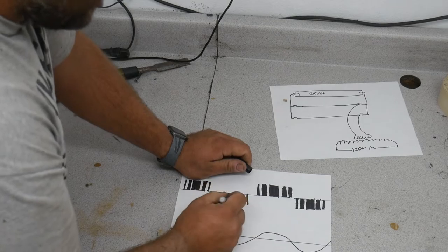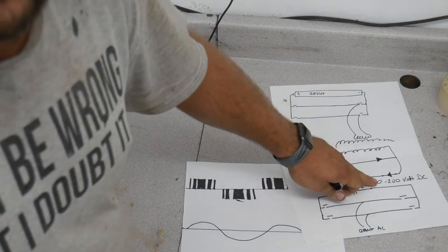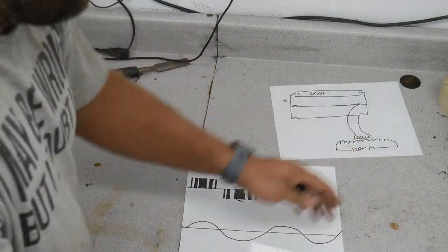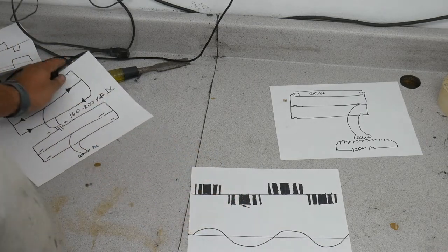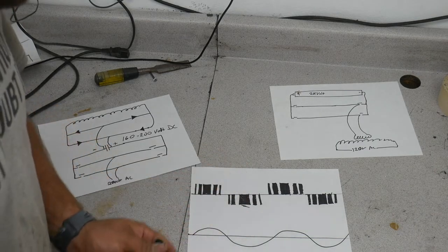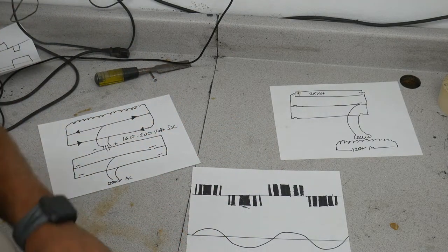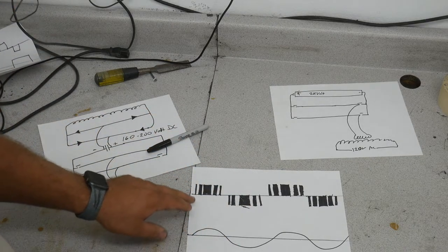But anyway, it stages, this voltage is the same way. This peak voltage is equal to your DC bus, or your battery voltage. If it's low frequency, you wouldn't have all this. But this peak voltage is equal to your bus voltage, and it's the same way. If your batteries are low, this voltage will fall, and the inverter will make wider each of these little power pulses.